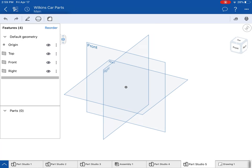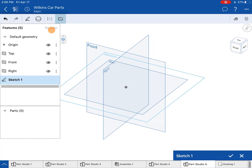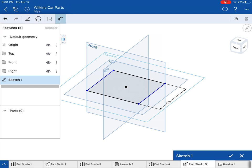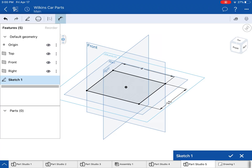First things you want to do is just start making something. I'm going to make a rectangle to start from. I'm going to go to center point rectangle, use that as my center point, and then out to there for now. Then I can dimension this — I'm going to go to dimension and dimension that side to be 3.5 inches, and then this side to be four inches because that's where it's going to attach to the rest of the vehicle.